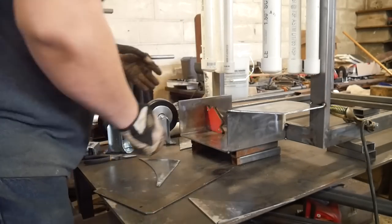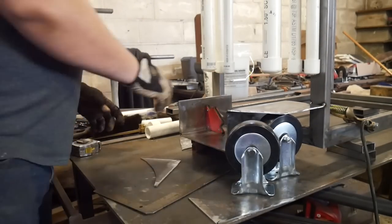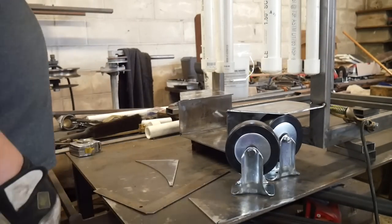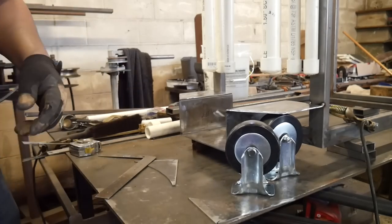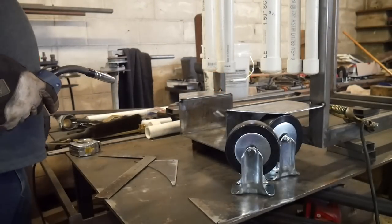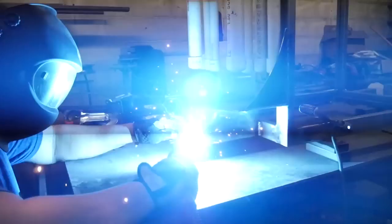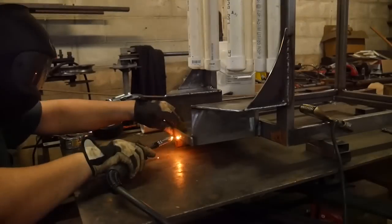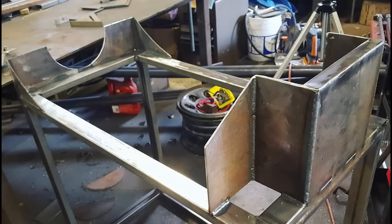Here's me assembling the last half of the tank tray and the caster mounts on the rear of the cart. The caster went underneath that caster mount with a little bit of ease — there's a little bit of a gap, so the cart is going to sit maybe about a quarter of an inch low. Just squaring things up and getting them all tacked into place — this is pretty critical because you don't want your casters to be toed out. I lost the footage of me mounting the casters, but it's just a bit of measuring to make sure they're straight and not toed out. This is the strap to hold the tank in its tray just in case it starts bouncing around. This is the mid-cart without the gussets attached yet, but this gives you an idea of the way it looks underneath the tank tray.